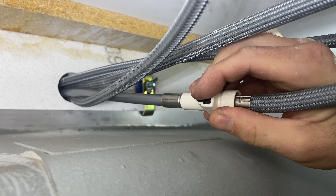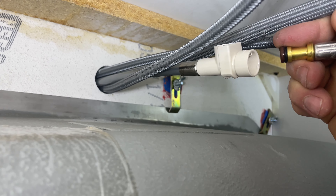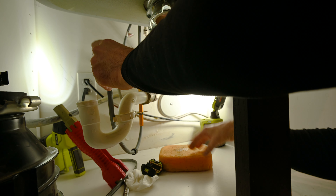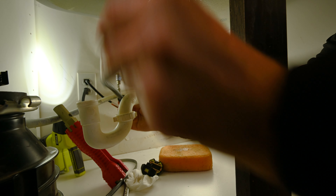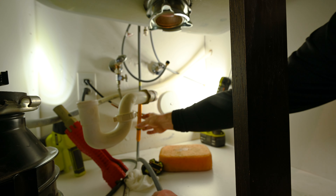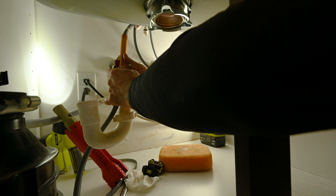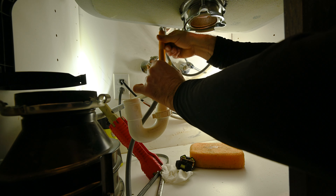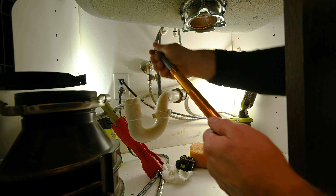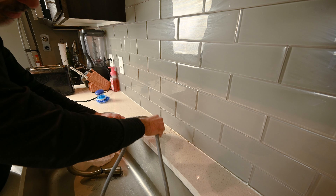There's a release button right here for the faucet sprayer itself — just push that in. Now your mileage may vary, but a lot of these quick hookups work like that. Probably going to be some residual water in here. Since this is already loose, I'm going to pull all this out. This nut will have to come all the way off. The faucet should just pull out now — you want to kind of do it one hose at a time.